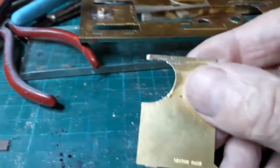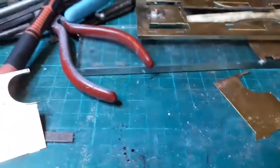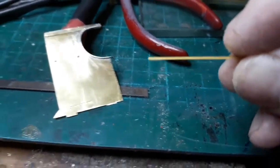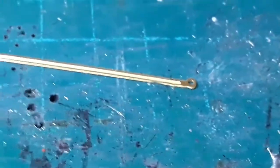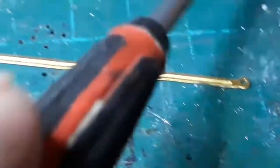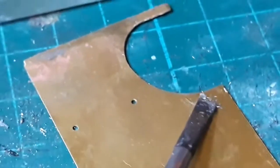There's a side with beading. With a strengthening piece. Here's the beading. It's got a half-etch line. Oh, sorry, I'm too close. You can see it's got a half etch, and that sits on there. So what I'll do is I'll get it right there with the handrail, and I'll start bending it and tacking it around in a few places, make sure it's right, and then I will solder it solid.